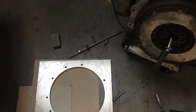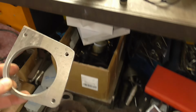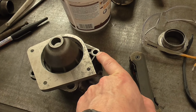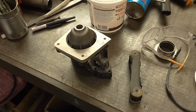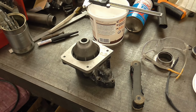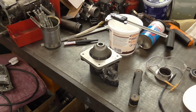I have made a new spacer plate, which is an accurate fit onto the register on the starter, and the mounting holes are a fairly accurate 8.5mm diameter, so I could again use a transfer punch, get those holes accurately lined up. And I may add some extra fixings to just keep the alignment from drifting, because obviously there's a little bit of wiggle room on the bolts. But that should get the starter motor issue sorted out.